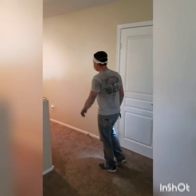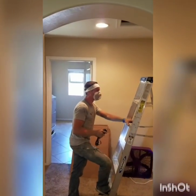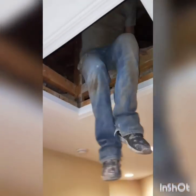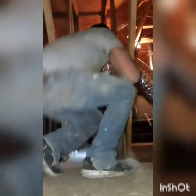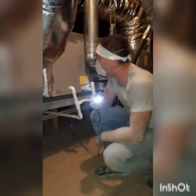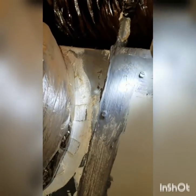We're out in Mesa, Arizona today. We're going to be adding six to eight inches of blown-in cellulose to bring it up to the R38 value. We have just about 3,600 square feet of attic space. We're also doing a duct seal touch-up. Originally when the duct system went in it was duct sealed, but during our visual inspection we came across some of the interlocking teeth — they're separating and allowing some air conditioning to escape right back into the attic space. We're going to go around and touch up all the units and make sure they're airtight.